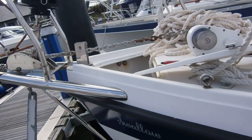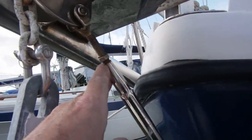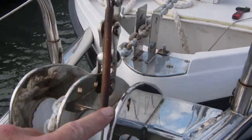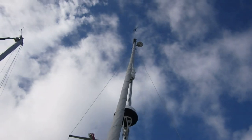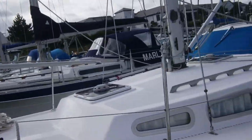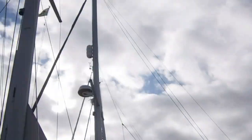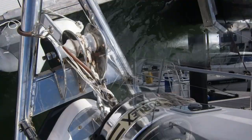Well, hey presto - that's done. I've slackened the nuts off inside the locker and slackened the bottle screw off a little bit here. I've also dropped my anchor down a little bit to make a bit of clearance at the back of the clevis pin. For a little bit of safety I've put a little strop on here so that if I let go of the forestay it's not going to disappear on me. I'm going to attach a line to the pulpit - the spinnaker halyard - like a safety forestay. Because my mast has the luxury of four lowers, fore and aft ones, and although they're still loose they'll still hold the mast up regardless. I'm not forgetting I've positioned the boat with the wind aft so it's blowing the mast forward, hopefully keeping the forestay slack.